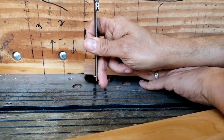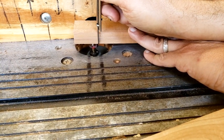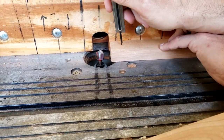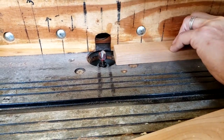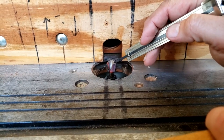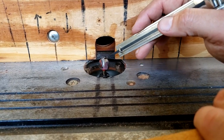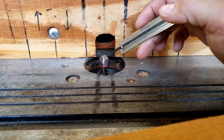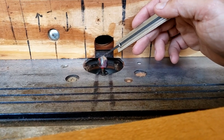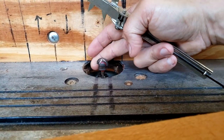I have a line here and here on my table — that's the width that this bit cuts. A lot of people ask why I always use a three-quarters inch bit. The primary reason is you can only get up to a three-quarters inch bit in most hardware stores — Lowe's, Home Depot, Ace Hardware. Those stores carry the largest core box bit they sell, which is what this is — also called a cove or flute bit.